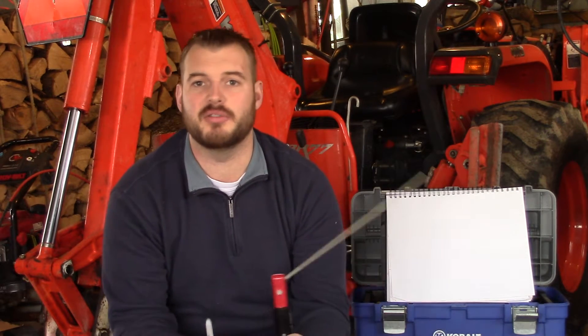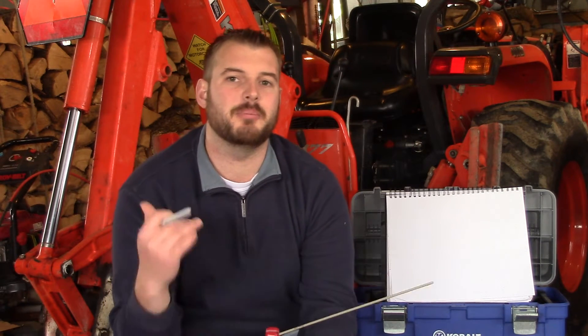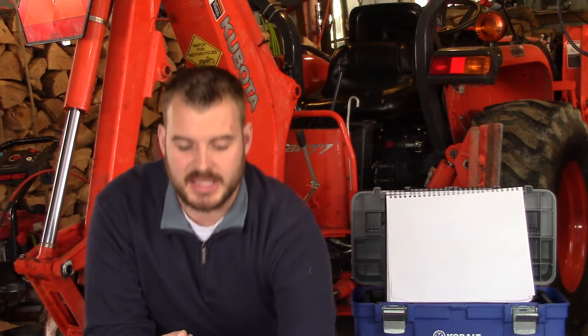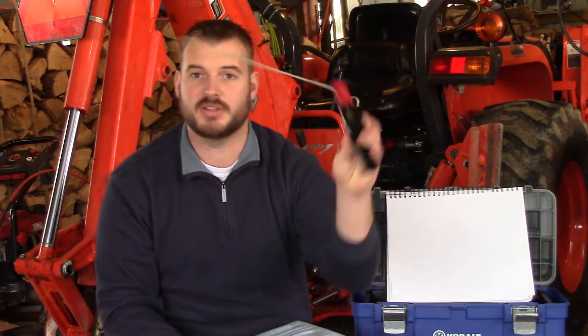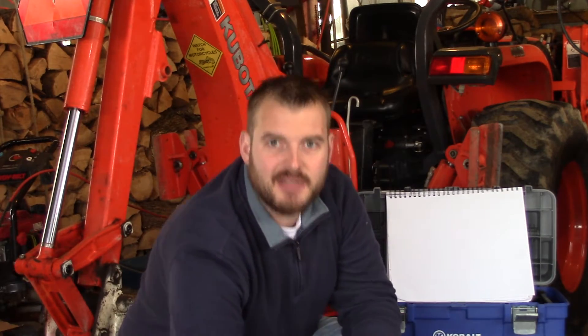If you're new to stick welding, you'll notice that there's a lot of different options for sticks out there — there's 7018, 6010, 6011, 6013, and a whole number of them. We could have a five-hour long video on all the different electrodes and all the different types of fluxes. But I'm going to try and make this pretty simple so you can get a basic understanding of what you're doing when you're buying a stick electrode. Stick electrodes are identified by an E, which stands for electrode, and then four digits following the E. As an example, in my electrode holder I have some 6011. Let's break down what 6011 is real quick.